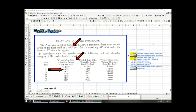So for the engineers designing the welds and preventing weld failure, without getting too deep into mathematics, we're going to just use the rules of thumb, all right? Because I think when you're out in the field, it's always better to use a rule of thumb instead of breaking out your laptop or your calculator. So typically, the throat, even though numerically it's 0.707, which is the square root of 2 over 2, we don't need to worry about that. That comes from Pythagoras. We're going to forget about him, and we're just going to assume that the throat is about 70% of the leg. Okay, it's close enough, 0.707.